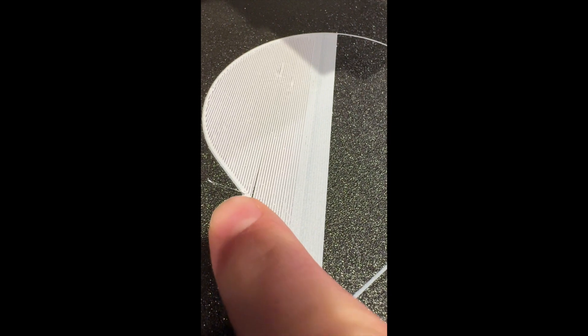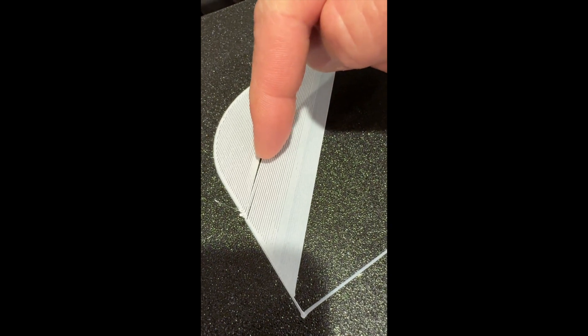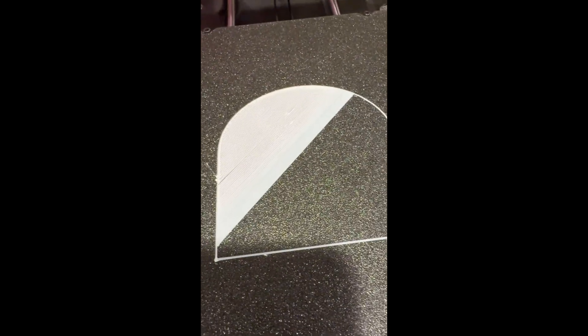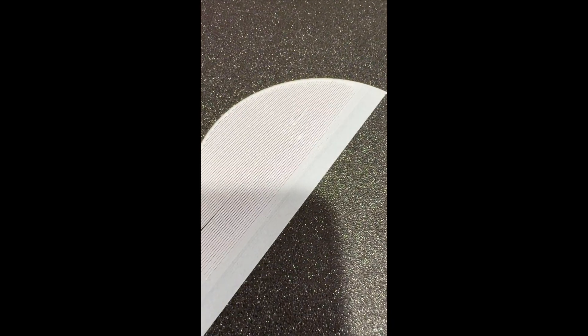See the difference there? That was the print when I first started. I think that's where all my troubles were — the print head was just a little too far away. See that, they're already coming loose. And now you can see how nice and close they are, and they're sticking together. Give that a try — it's made a huge difference, at least for me on this printer. I hope somebody has better success with it.